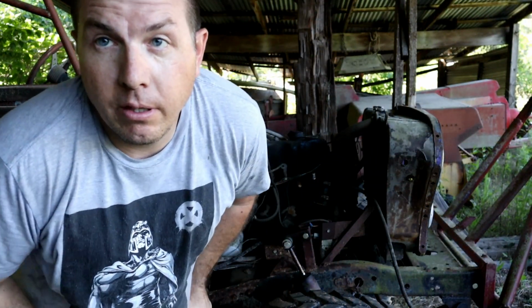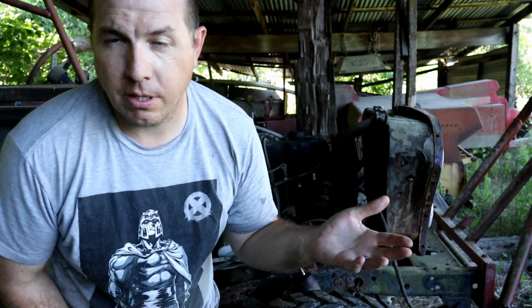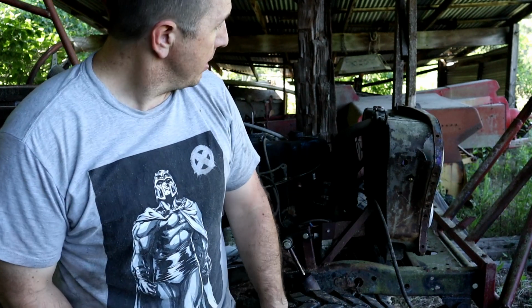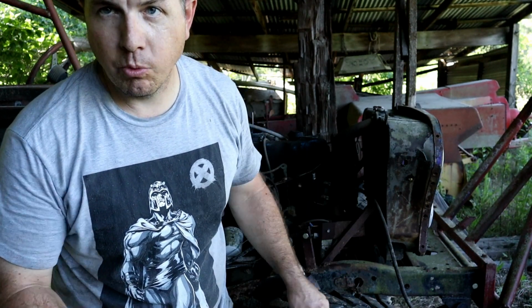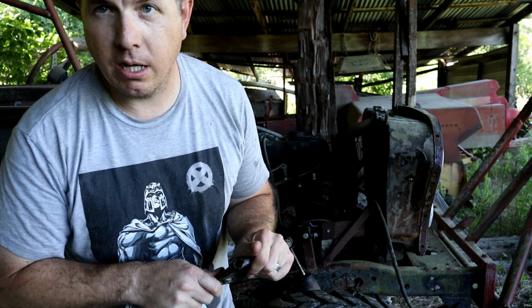Alright, now that we've got the fuel system kind of where we think it should be, with penetrating oil, seafoam, stuff that breaks down the varnish, both in the carb and in the gas tank, and now running through the fuel pump. Let's just go ahead and see. We'll put a wrench on the front of that crank and rotate it and see if the pistons are free.